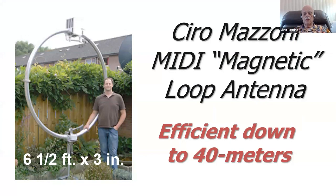The only relatively efficient magnetic loop that I've ever seen on the market that'll work down to 40 meters is this one. It's the Ciro Mazzoni MIDI magnetic loop antenna. Any other magnetic loop I've ever seen on the market will not efficiently go down to 40 meters. I don't care how wonderful the ads are on the internet and in the magazines, they are not efficient down to 40 meters. And how big is this one? 6.5 feet in diameter, and it has 3-inch diameter conductors. This one will make 40 meters efficiently. Nothing of less than this kind of dimension is going to make 40 meters efficiently.